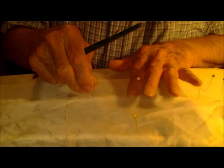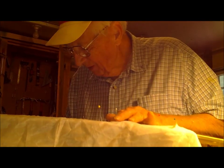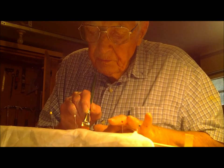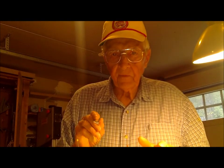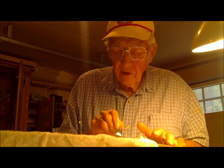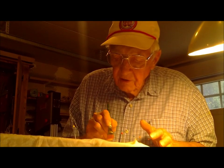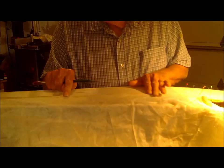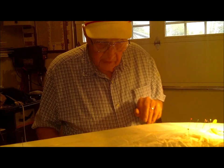You have to do a little trimming after you stick this one down. When you put that on there, it will go through the fabric and stick to the first coat of nitrate dope you put down on the bare frame, on the bare perimeter of the frame. It'll soak through and join up with the glue. Let that dry for just a little while — so it's dry to the touch — it dries real fast, and then we can go on the other side and fasten that.